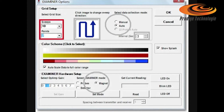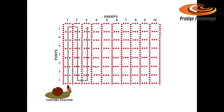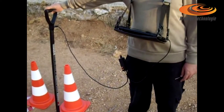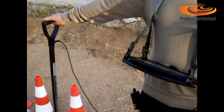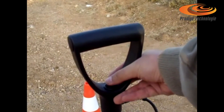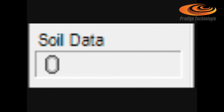Enter the grid size. Sweeps must be equal to the points to get a good scan image. Sweeps are the parallel lines you plan to divide the field, and points are your steps on each sweep line. Ensure auto scale is on. Click set mode and OK to exit. Before starting a new scan, the first square must be on a piece of ground that is not been dug and free from metal. Now, extend your arm away from the screen and your body. Place the magnetometer tip on the ground far from any metal. Power on and wait 15 seconds, completely motionless, while the GeoExaminer will automatically zero the soil data. Then start scanning with the magnetometer tip touching the ground on each step.